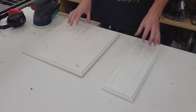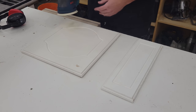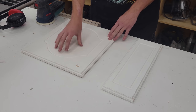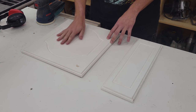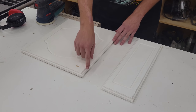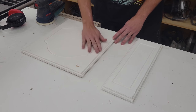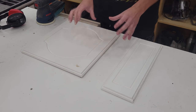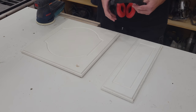With all the doors and fronts removed, the first thing I'm going to do is use my random orbit sander with 120 grit sandpaper and do a quick light pass on all the fronts. This is going to knock down all the little high spots, bumps, and fuzzies since I never really sanded these originally. I want them super smooth because the next step is at the router table, and any bumps will translate directly into the edge when it goes up against the bit.